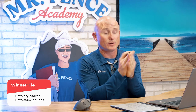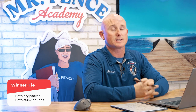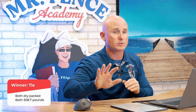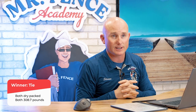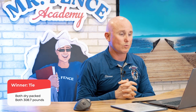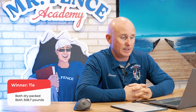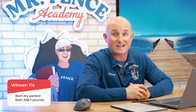2x4s laminated together, turned in two different directions, are both dry packed in this case. There was no wet set. This was a 2x4 test to see the idea of setting two laminated 2x4s together instead of a 4x4 wood post, because we would have cross graining, less warping and twisting. We also have less splitting and checking because the dimensional lumber is smaller. They both failed at the same point. That's interesting, no matter which way they were turned. And the other very interesting part is they failed at the same point as a postmaster.